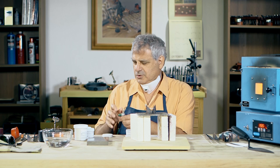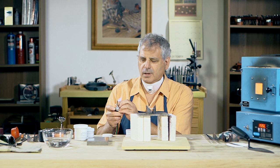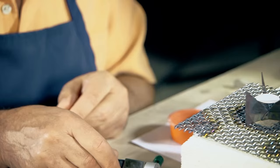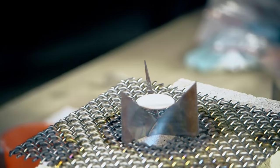To start with, I'm going to turn on a little bit of the gas — which is the red — and hold it to the igniter and I'll get a little flame. Now I can add some oxygen. I want my flame to be a little bigger, so I'm going to add some more propane and more oxygen. What I'm going to do in this firing is fire the piece until the surface is glossy. It'll go through our normal firing stages — sugar fire, orange peel, to glossy — and then we'll take a look at it.